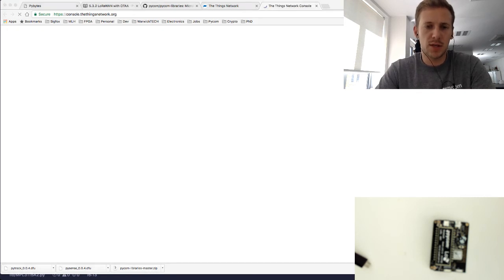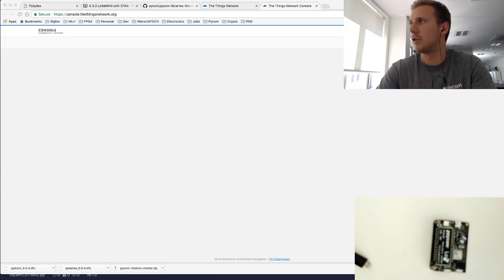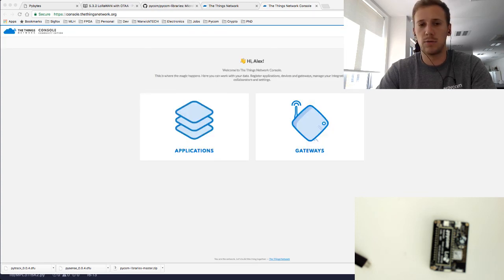Did you use the example code from the documentation regarding the single channel LoPy nodes? Because if you don't have your channels connected or configured correctly, then you might have issues actually getting it to work. Device node stuck in the LoRa connection. Okay, so this might be because of your code on the node side of the device. Are you using OTAA or ABP connection types?